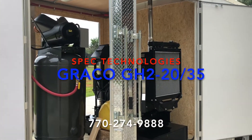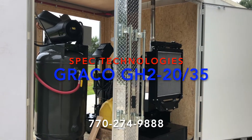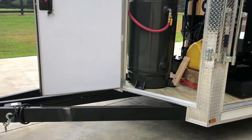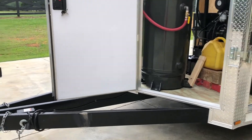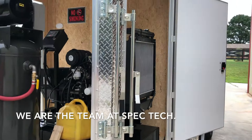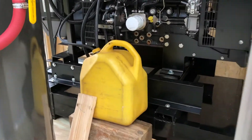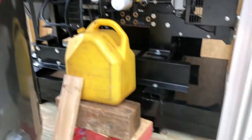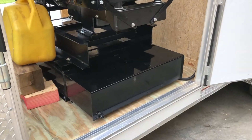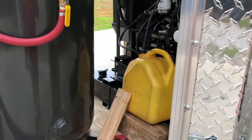I just want to show you a build we just finished here, mid-September 2021. This is a 16-foot trailer, nice big heavy 6-inch frame, extended tongue. You'll see here we've got a 30KW three-phase generator. This fuel tank is just temporary so we didn't have to fill that belly tank — that's a 50-gallon tank down there. You can fill it easily from the fill cap, you'll see it over there right in the corner.